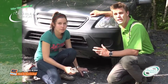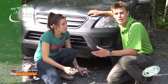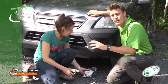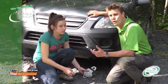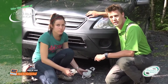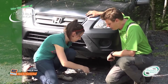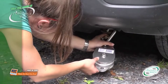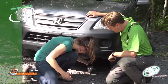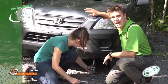So now let's see how Amélie was able to pull the truck. It's quite simple. She used a block and tackle system, which consists of a few pulleys installed, which will increase the pulling power but will reduce the speed. So the first step that she did was to install the first pulley at the load.